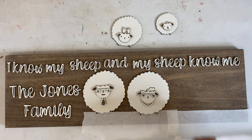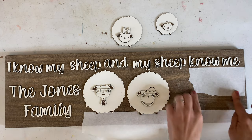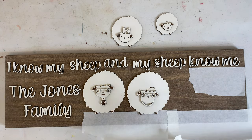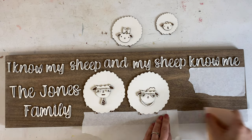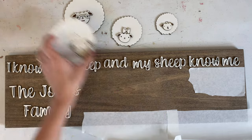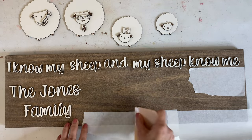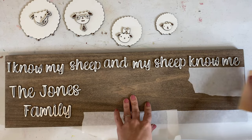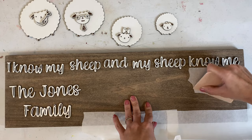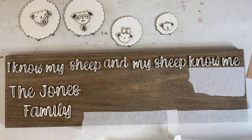I'm going to take these pieces off and put masking tape right where they'll go. Then I'm going to take my squeegee — make sure you squeegee it down. This is one of the first mistakes I made when I started with my laser and I almost started a fire because I did not squeegee down my masking tape. So make sure you do that — super important. Then I'll cut off the excess and throw it into the laser.